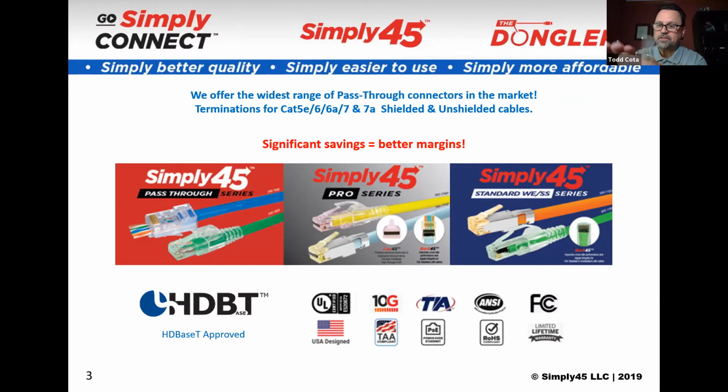So when you crimp it, it's not just going to crimp the ends of the wires like traditional solid body front connectors. That's what happens. You get a piece of the wire, then with any kind of cable move, you could actually get an intermittence or some kind of disconnect. So this gives you three really solid call outs for a positive connection every time: wire sequence, solid contacts, and minimized force. So that's a pass-through.